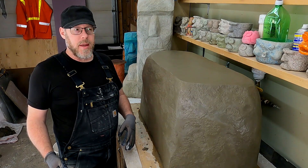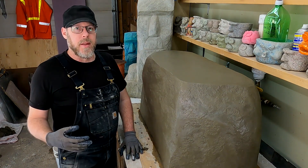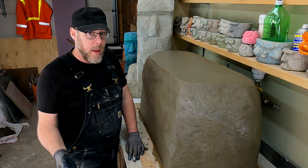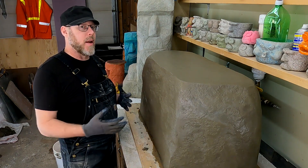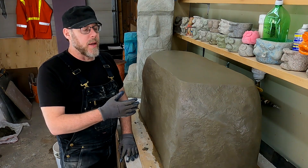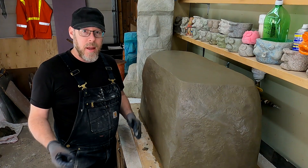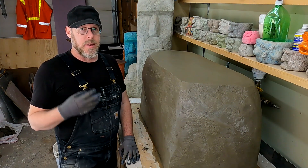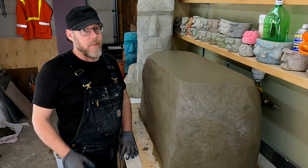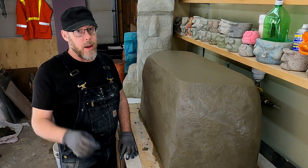You would typically want to begin when the concrete is hard, no longer soft to the touch, and not going to experience any erosion from the water. You don't want to damage fresh concrete — you have to let it set up first. Once it's set up, begin watering it down multiple times a day, up to and including continuously. The first three days is the most important, followed by a week. If you're doing a week of hydration for newly poured concrete, you're doing really well.